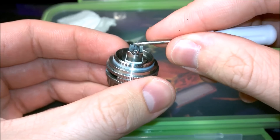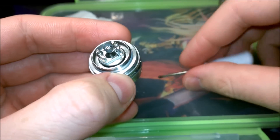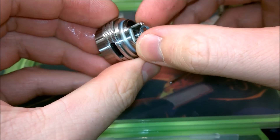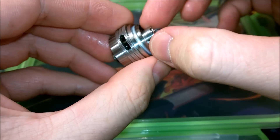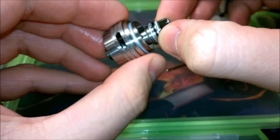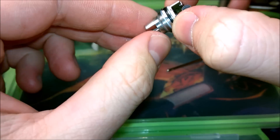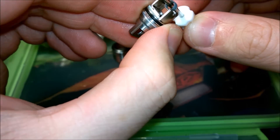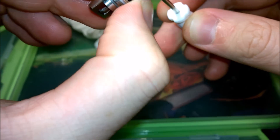The two middle coil wraps are a little bit too close together, so it's a good idea to try and push them out. I'm just going to take it off first, loosen it off — it is quite hot. I'm going to straighten it up one more time, because if you heat it up and it gets that hot it can distort out of shape a little bit.